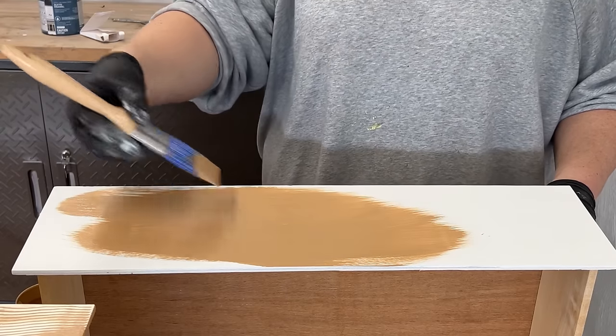The next morning I needed to seal up the wood pieces, so I reloaded my cleaned-out gun with some matte polyurethane and sprayed two coats over all of that. Once dry, I needed to figure out where to drill the new hardware holes. I had these pulls that sit over the top edge of the drawers so I don't have to interrupt my new pattern too much with hardware. Since the original handles are just painted metal, I gave them all a wash with Simple Green, scuffed them up, and then painted them all to match with a satin bronze metallic spray.